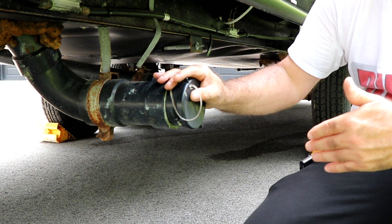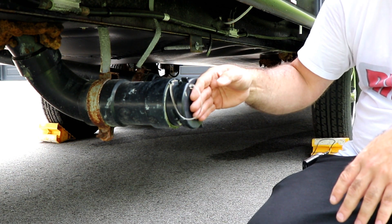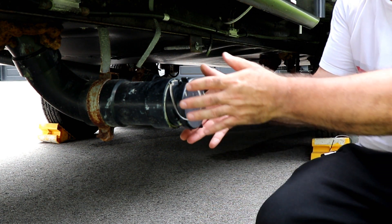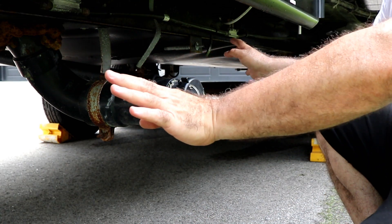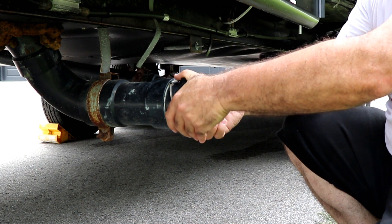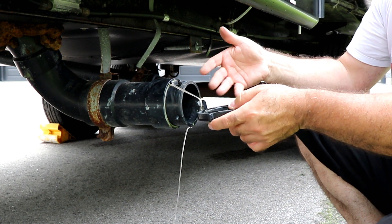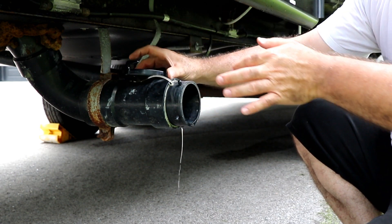You may find yourself with a mess — because those valves are open and the only thing holding back the liquids is this cap. If they were open, what you're going to want to do is get a bucket or some sort of container and open this really slowly, because you're going to have some liquid in there. Normally if you close your valves before you connect, give it a couple of minutes to drain, and you're not going to have any water here. So I'm going to remove the cap — they're usually very snug, you give it a counter-clockwise turn and the cap will pop off. You'll notice just a little bit of clean water came out.